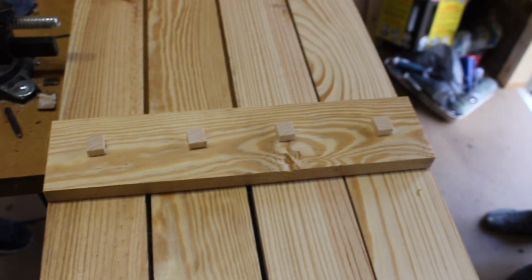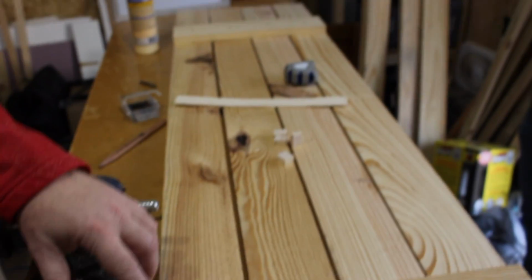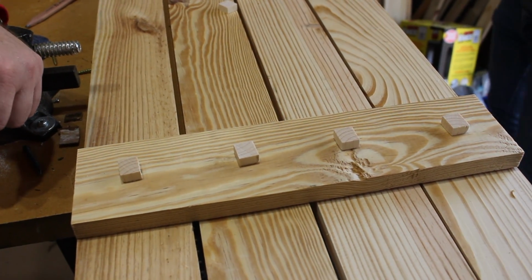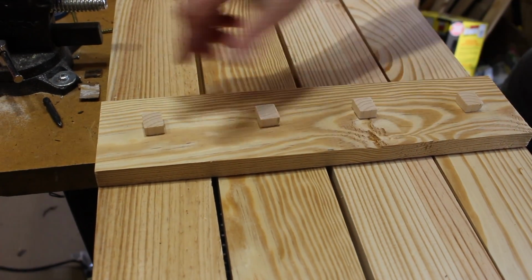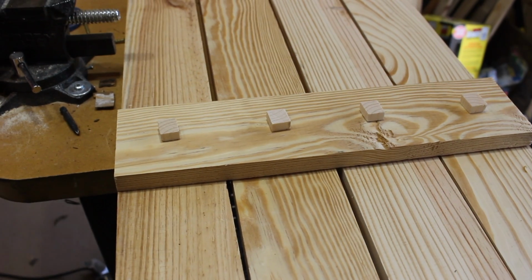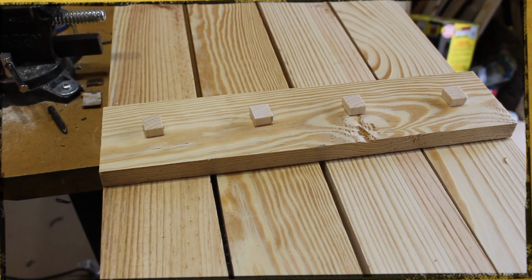We prefer this other look that looks like we've used square dowels to connect the pieces. But the screws are fine depending on how your house looks and what your taste is. You can see the difference, and that requires a little extra work. It doesn't cost anything because that came out of scraps. I think it adds a little bit of visual detail. You could even, if you had some gate hardware, attach it here, like wrought iron strapping. That, of course, is pretty expensive, so we're going with an alternate method. All right. So we're going to use Liquid Nails to attach the little squares. And we're going to be right back with flush fit.